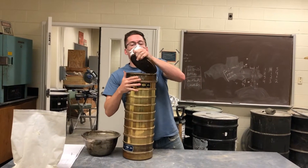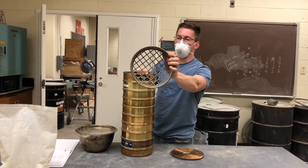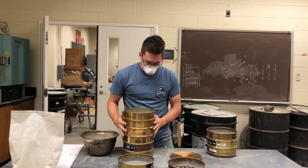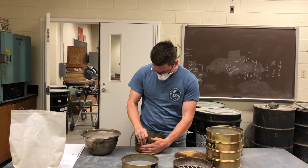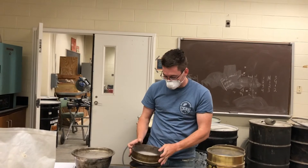So I'll show you what this looks like. This is the 3/4 inch sieve. Here's a smaller one — this one is a number 8 sieve. And then the number 200 is right here, and this catches dust in it. It's 75 microns — very fine material.